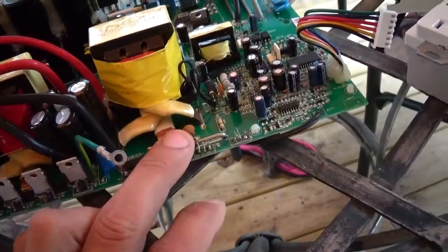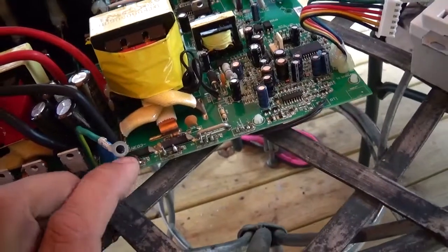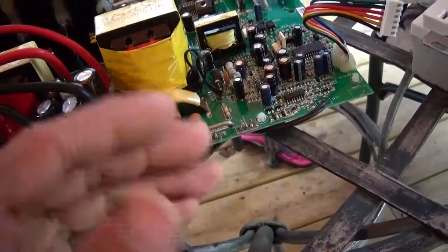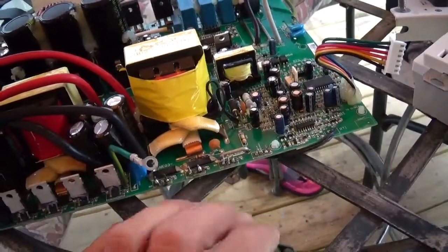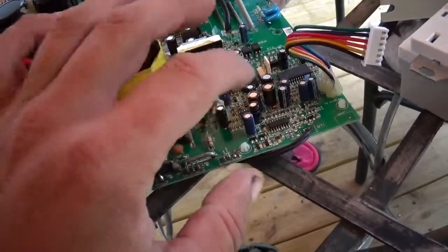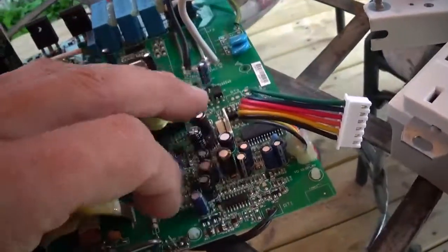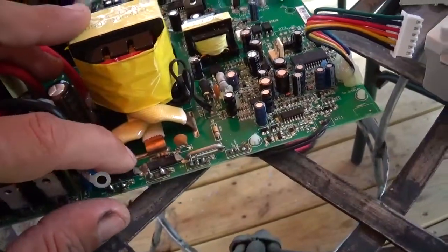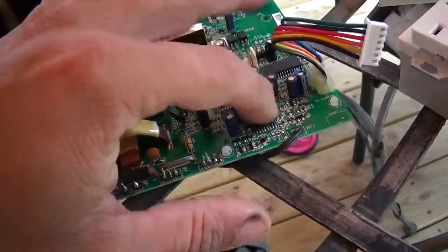So that's not the reason why I can't fix it. I kludged some in here that is generally what you find in one of these machines. It should have worked, at least tried to work with the ones that I stuck in it. Problem is that an oscillator's bad. One of these ICs right here, surface mount, wee little tiny microscopic things with legs, is bad. I checked all the emitter resistors, they're all good. It's an oscillator problem.